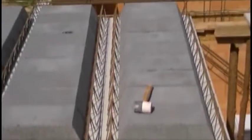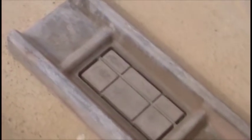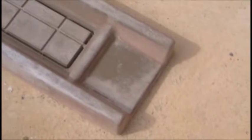To complete the rib, we have to do some formwork again. Since the execution of the formwork is relatively time-consuming and laborious, it is good to choose a ready-made solution consisting of a set of pre-made formwork systems which use keramzit shapes. We can see two types of formwork. Those which are presented now in L-shaped cross-section we will put on the external walls. Shallow gutter-shaped shuttering we will put on the interior walls in places where balcony slabs will arise, and in our specific case the walls of the outer corners facing the interior of the building.